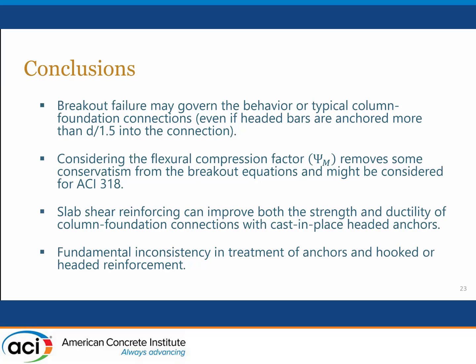I think there's a trade-off between how thick you make the connection and how much shear reinforcement you need. The designer has a couple of options to play with: one being the thickness of the footing, and the other being the amount of the candy cane bars. The extent of the candy cane bars seems to be pretty well delineated by being within a perimeter located at a distance equal to the depth of the connection. We looked at that analytically, and the Athena results suggested that having the candy cane bars within about 3/4 of the effective depth was sufficient. But I didn't trust the analytical results enough to not try extending them a longer distance on one side.